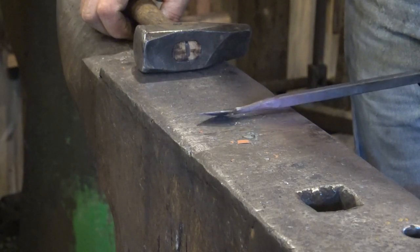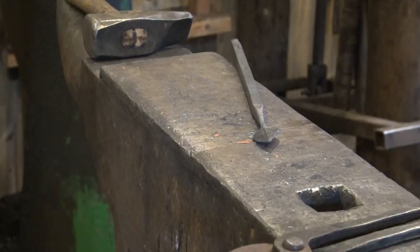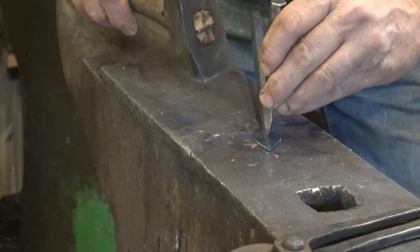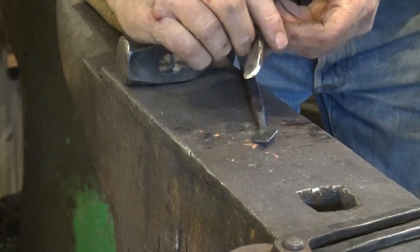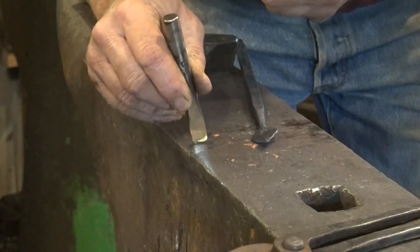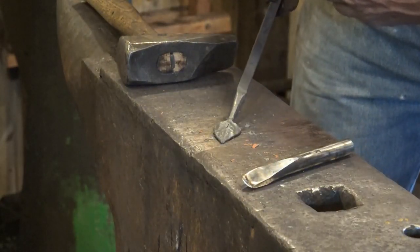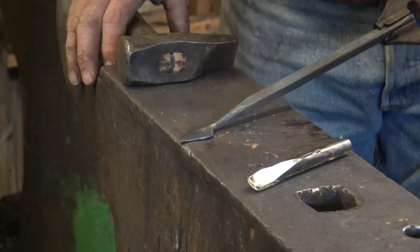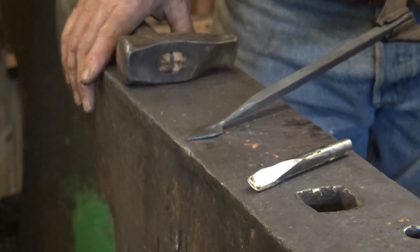Now at this point you can do the veining hot at the anvil if you want to, and really you can do it pretty much at this heat. But it can be hard to hold on to. This little chisel is round in this direction so that it walks very easily and doesn't leave chop marks — you walk it along as you run your veins. I think I'd rather do this under the treadle hammer. Since we just showed that treadle hammer video, this is one of the jobs that really pays off under the treadle hammer. So I'm going to let this cool until I can hold on to it with my bare hand, do a little bit of filing to clean up the edge, and then go ahead and chisel it.